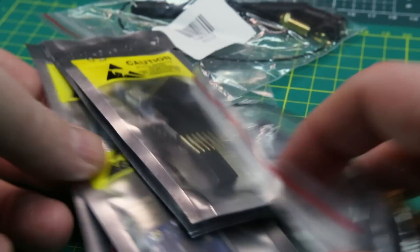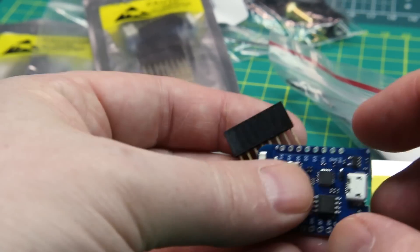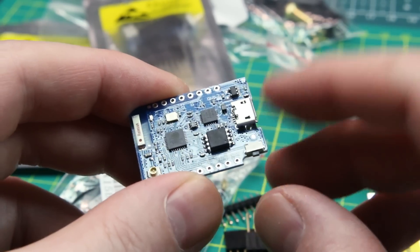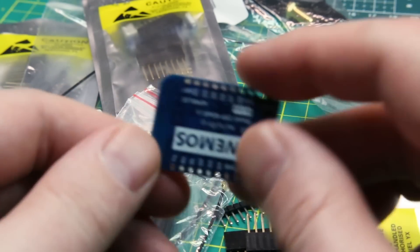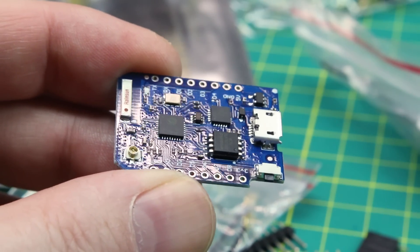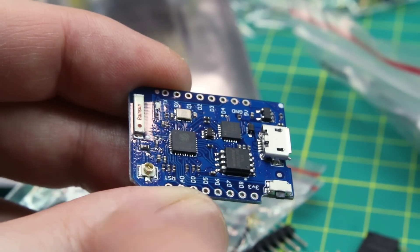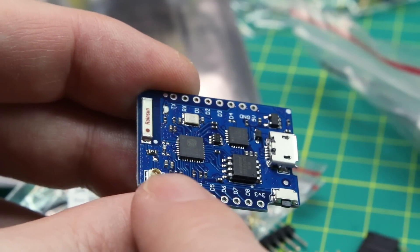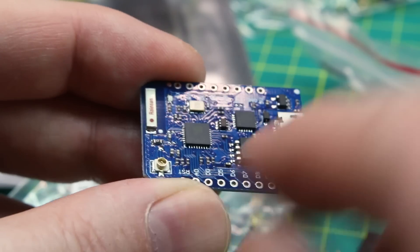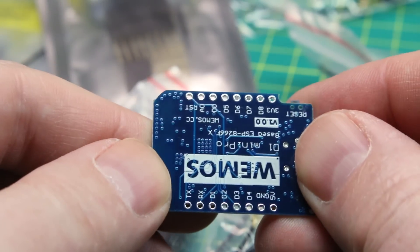To work with those we got all of this. These are new on the channel — I've never had one of these before. This is the Wemos D1 Mini Pro, an ESP8266 microcontroller, but it has a unique advantage. On the board here we have an IPEX style antenna connection as well as an onboard ceramic style 2.4 gigahertz antenna. We just need to move that resistor over — it's a zero ohm, just a shunt essentially — and we can hook these external antennas right onto this ESP8266, which is very interesting.